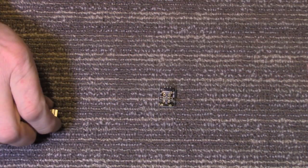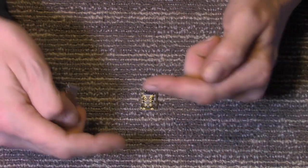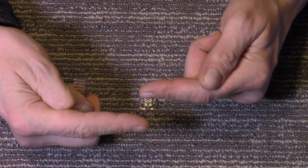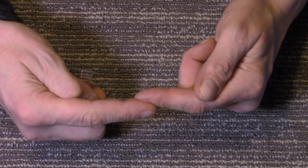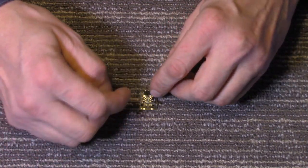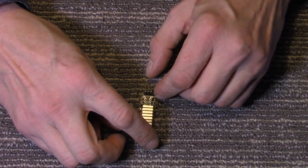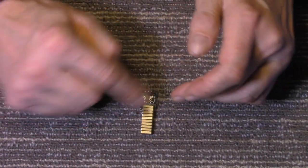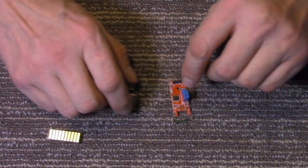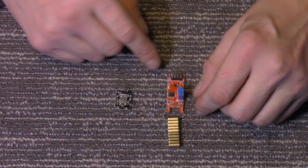Simple. Now with this one, when there's nothing going through, nothing's connected, because a reed switch is just two reeds. And when the magnetic field is introduced, it just makes the two reeds stick to each other. The magnetism affects them and makes them stick. So with this one, your output would be low, but when you put your magnetic field into it, it would allow current to flow through it. The only real benefit to this one I would see is when there's a magnetic field present.